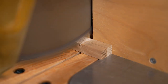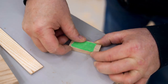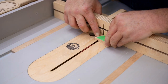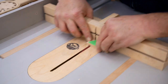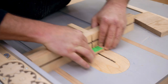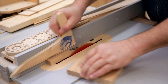I need two of these parts and they're going to be exactly the same, so I'm taping them together so that I can cut them both at the same time. The cut that I'm making here is a 1/8 of an inch deep recess, and I'm doing that on my table saw with my mini table saw sled in several passes. I know it looks like my fingers are very close to the blade here, but the blade is not sticking up very high and I'm definitely not going to touch it. These next two pieces are very similar to that first one, except a little bit bigger.